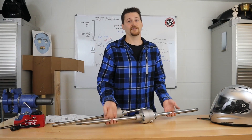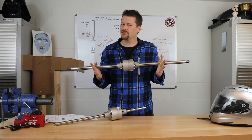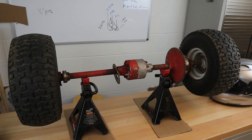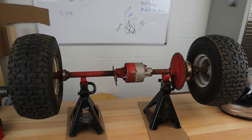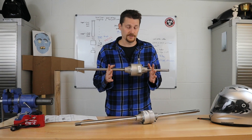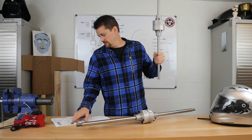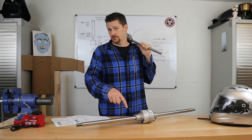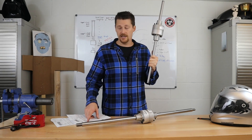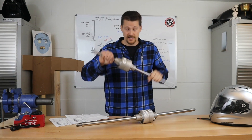There are two different differentials available: the one-inch and the three-quarter inch — both are Peerless 100 series. The part number for the one-inch differential is 794102; the three-quarter inch is 794292A. I picked both of these up at SEPW, Small Engine Parts Warehouse. They were very helpful, by the way.